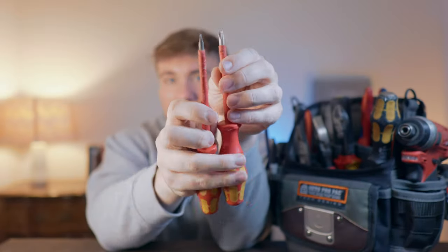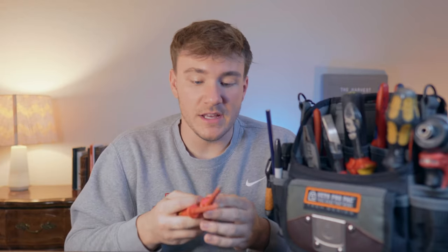Day one also includes screwdrivers. These are from Wera and I like the individual screwdrivers much better. A lot of people like the five-in-one or eleven-in-one from Klein — that works too and saves money. I prefer the smaller shafts. The eleven-in-one is about ten dollars; a set of Weras is around thirty and gets you all the sizes you need. You don't have to get insulated tools, but I personally like having that insulation. Wera is the brand I'd recommend.